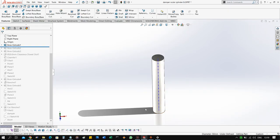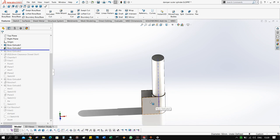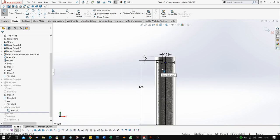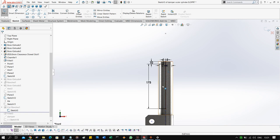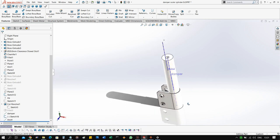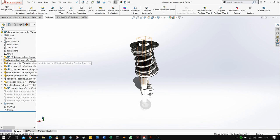Let's move on to first design the strut itself. You start by making the cylinder of a certain length as per your requirement, then you place the mounts for which the knuckle arm will be mounted on. Then you add the holes for the bolts that go into the knuckle arm, make a few changes like chamfers or fillets, then you make a hole inside the entire cylinder where the piston of the strut will move. The cut revolve section creates an entire cavity inside this cylinder. If I show you the section view, it will be a cavity in which the piston will move up and down.